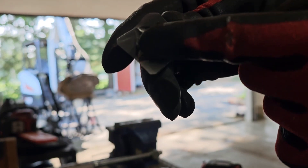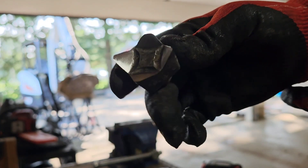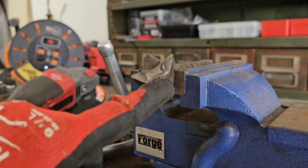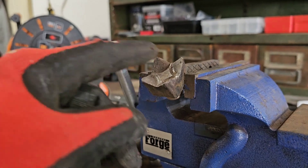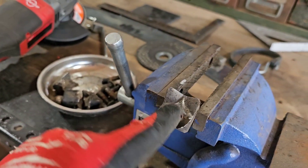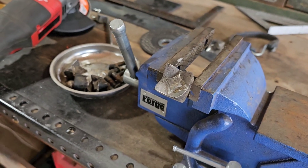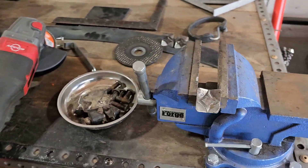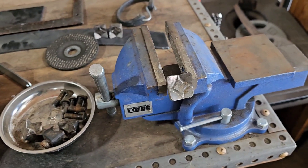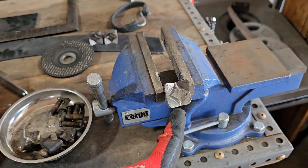We're just trying to flatten this edge out, that's it. Here's an example of a bad one — it's starting to cup in. So you want to take that flap wheel disc and flatten these out, not too much though. Just maintain the shape that it's in, and that will naturally sharpen these edges.